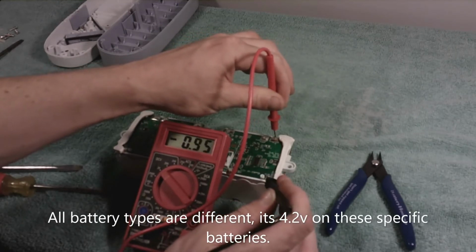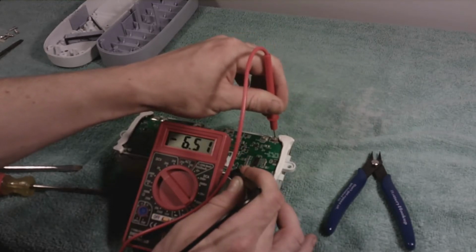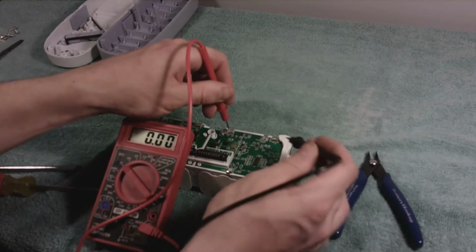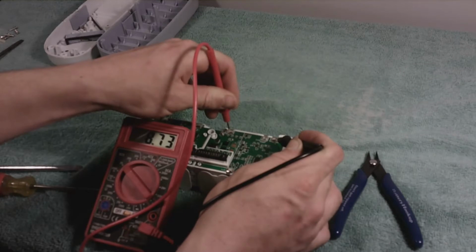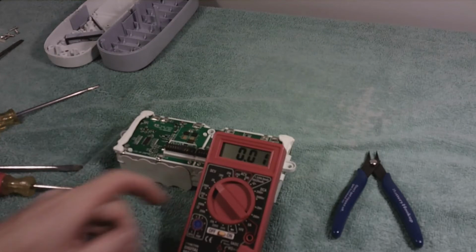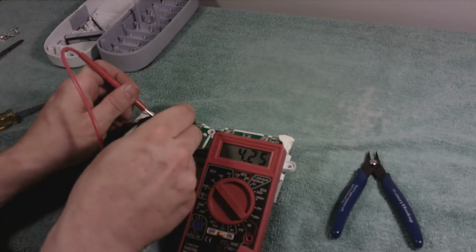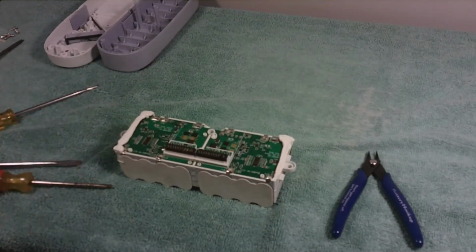And so what is thermal runaway? Well, thermal runaway is a chemical reaction in this battery that can happen when you go above voltage or if you create too much heat. Creating heat on this battery actually increases the voltage on it, and it can increase its output. And so when you start charging it too much, it can start getting really, really hot, and it has this runaway effect, and it eventually will catch fire if you overcharge these batteries. So that is obviously bad. Nobody wants a fire. Another way to do that is to puncture these batteries. They will catch on fire.